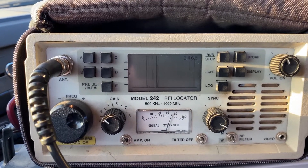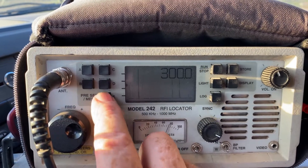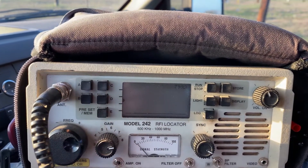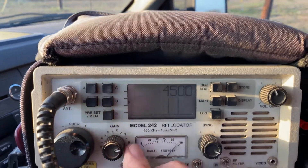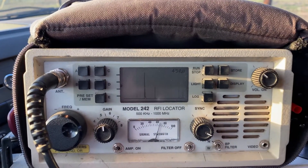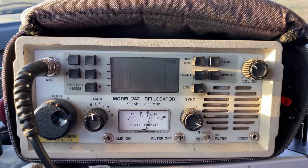So that's 146.8 on the truck. When I see something like that I just start walking my way up - 300, 450, full gain - run up to 799 if I'm still driving. And when 799 looks like that, I just take my hand out of the truck and the pole that I'm closest to is the pole that has the noise on it. Pretty effective.